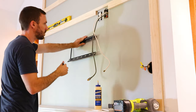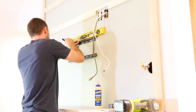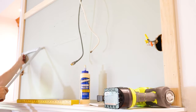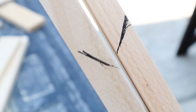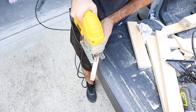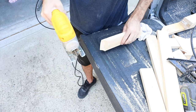Now I'm mounting my TV bracket so I know exactly where the TV will go. This is important because the TV needs to tilt down from up on the fireplace, but tilting it down requires room behind it — so I'll need to cut some slats short. The mount is also directly in the way of a slat. I hung the TV up temporarily so I can make the bottom slat pieces fit perfectly, traced the curved line to match the curved back of the TV, then cut those shapes out with the jigsaw. I'll sand them, wipe them down, and get to installing.